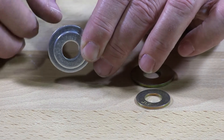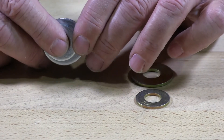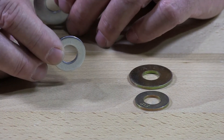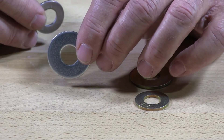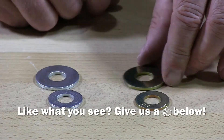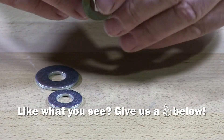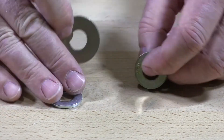These are standard flat washers. If you order an SAE flat washer you're going to get the smaller one. The USS has a larger outside diameter. That's in standard zinc. I also have in yellow zinc the same thing, which are basically grade 8 flat washers.